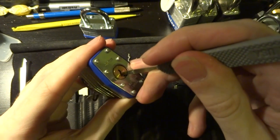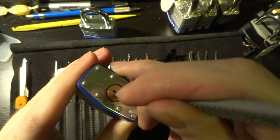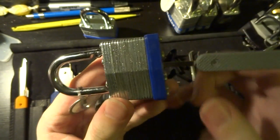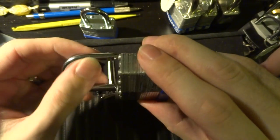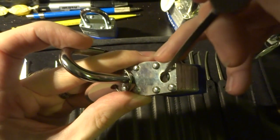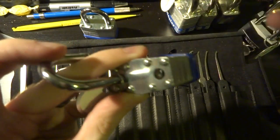So really what you do is you just slide it in here, push the pins out of the way, and you're just feeling around in the back — there you go — for the interior part of the latch. Which actually is what holds this closed. If you can just see in there, this piece right here, which hopefully you can see moving around in there as I poke it — that's the latch.